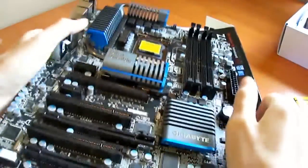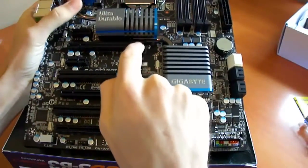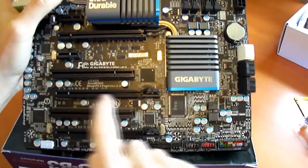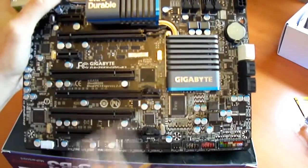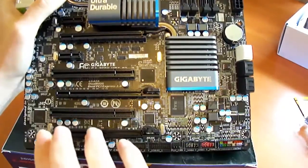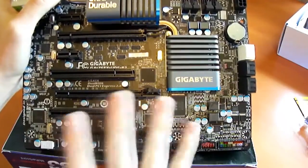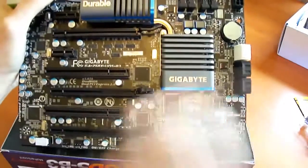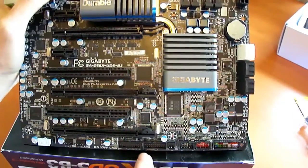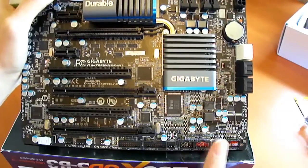We've got all the expansion slots: PCI Express X1, PCI Express X16 running at full X16 bandwidth, another PCI Express X1, a PCI slot, a PCI Express X16-length slot that is only wired electrically up to X8, another PCI slot, and a PCI Express X16-looking slot wired up to only X4. It's preferable not to use that last slot for any high-end device like a video card, as it runs off a different chipset. We have a 4-pin system fan header, 2 USB 3 front panel headers, USB 3 and USB 2 front panel connections, and the red-label on/off recharge header.